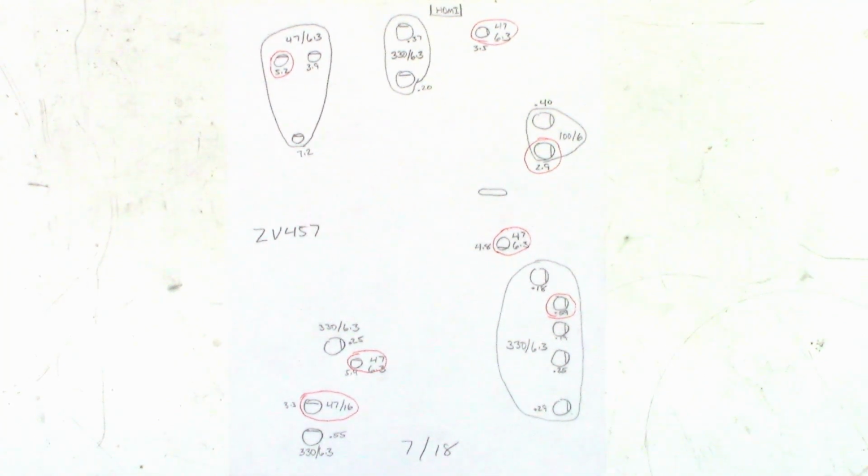So I'm just going to go ahead and zip them off the board. I'll use the twist off method and then clean off the pads. Now the new replacement capacitors that I'm going to be installing on this board are the standard radial leaded electrolytics. So a lot of these I'll have to bend over to put on the board. You've seen me do it before, but I'll do a real quick, maybe a time lapse of me getting the capacitors off of the board.